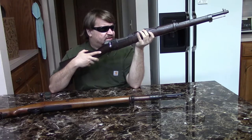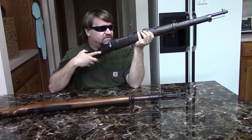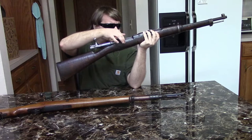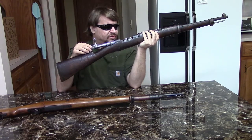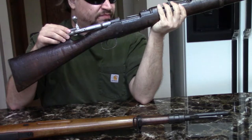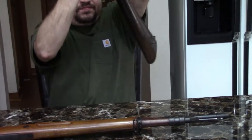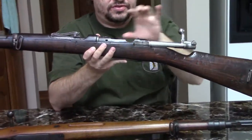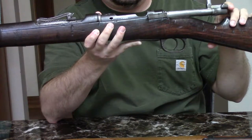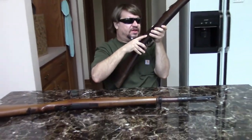The Model 1916 would remain in production into the 1940s and remain in use well throughout the 60s. It's chambered for 7mm Mauser and is a small ring. One addition they made to the action: they put in a retaining guide in the receiver for the bolt that runs along the same channel as the ejector cutout, just to stabilize the bolt a little better. They also added a gas relief hole in the side of the receiver for ruptured casings. Other than that, the action is still very standard 1893.